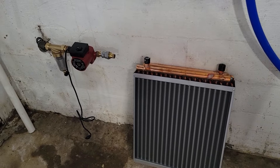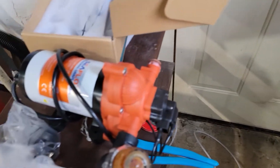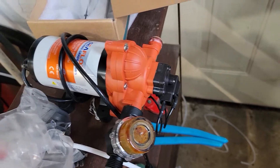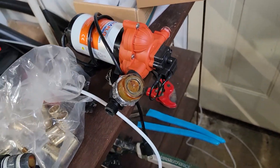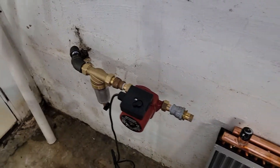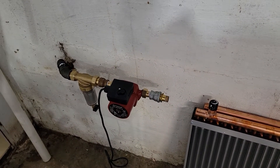Last year I tested out this cistern just to see if the pipe was still good, and it actually worked. I had a diaphragm pump hooked up to it, which is self-priming but not continuous run — it doesn't have a very long duty cycle before it will overheat and burn out. That was hooked up to one inch PEX going out to an outside hydrant to water the lawn and the garden, and it worked quite well.